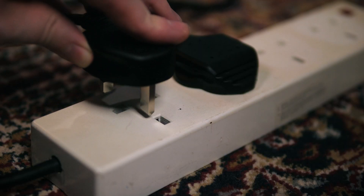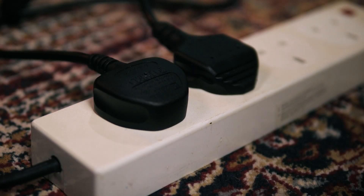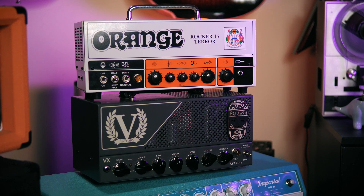That hum is quite often generated by voltage injected into the ground connection of the mains supply, which can start pushing currents around the ground connections of different devices plugged into mains power at different places. Ground loops and other ground-related issues often manifest themselves as ugly hum in audio devices like our guitar amplifiers, and it can be perplexing to predict precisely when power will present problematically prior to plugging in.